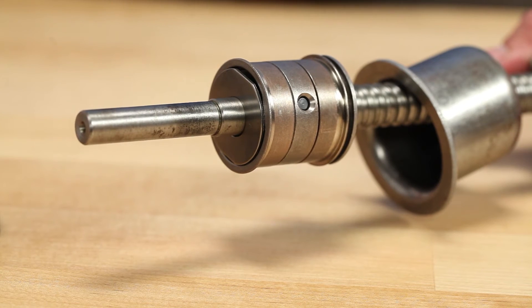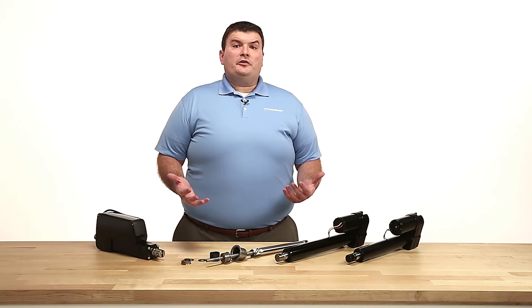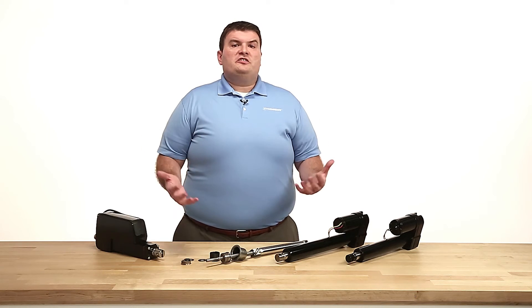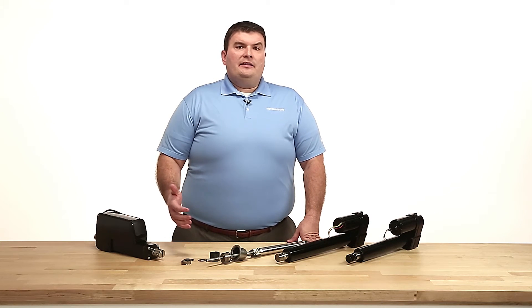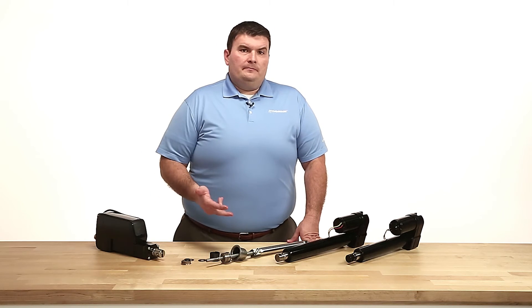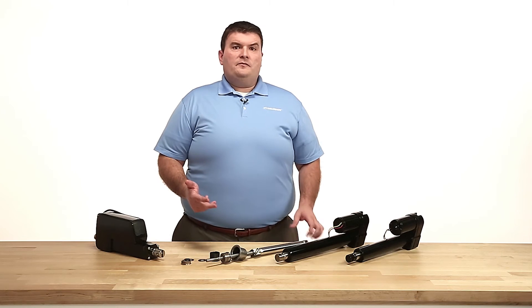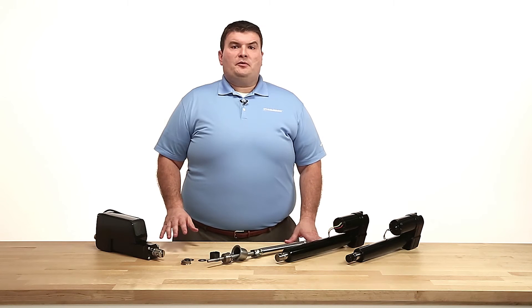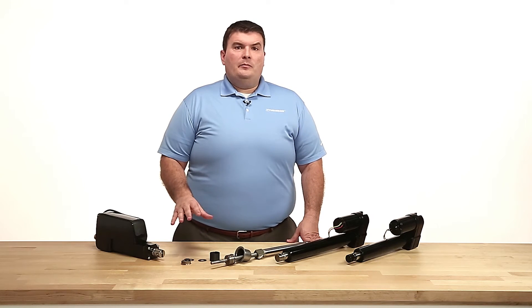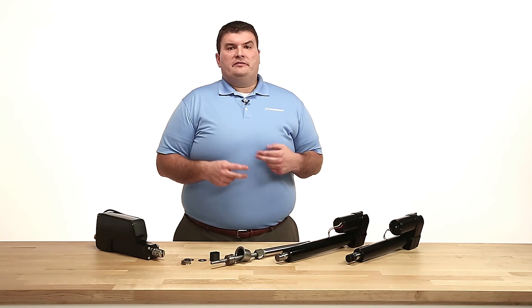So, how does the brake assembly work? If the actuator is extending under a compression or resistive load, the wrap spring slips on the compression hub and the compression needle bearings rotate. All other parts remain stationary. If the actuator is retracting under a tension load, the wrap spring slips on the tension hub and the tension needle bearing rotates, while all other parts remain stationary.